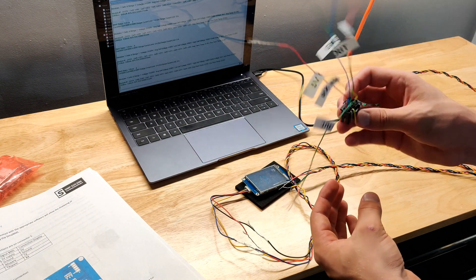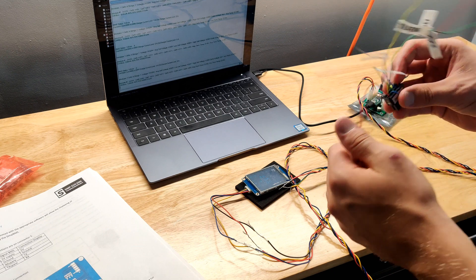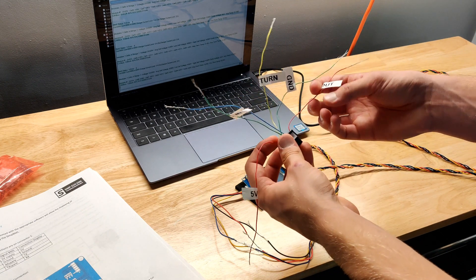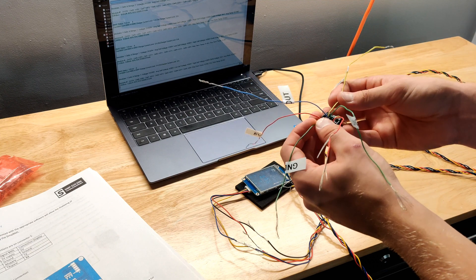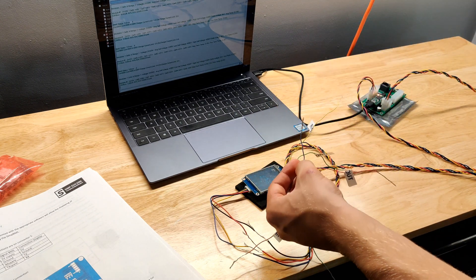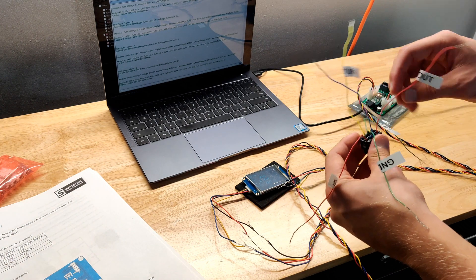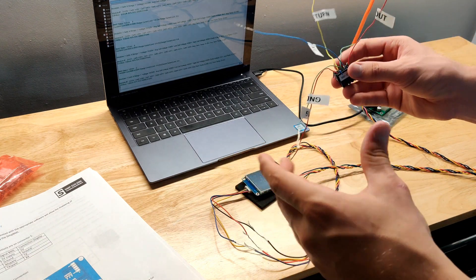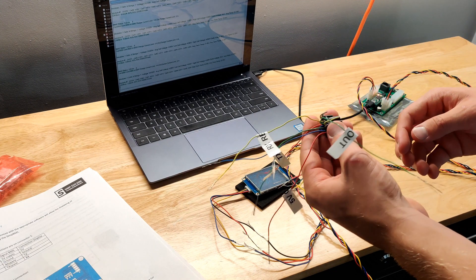I have one of the plugs that I gutted from one of the modules and labeled everything. I kept six of the ten connections on this plug: the five volt in and five volt out — it's a continuous string of five volts — the two ground connections in green, and the TX and RX connections. TX is the signal out and RX is the return signal. These go to every module. I cut away the four wires I didn't need and trimmed them down, so the connector just has the cables I'll be using. I'll have to do this to all ten module pigtail connectors.